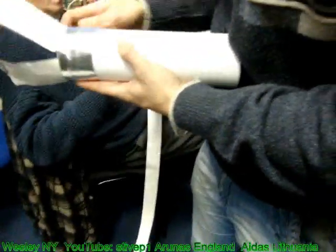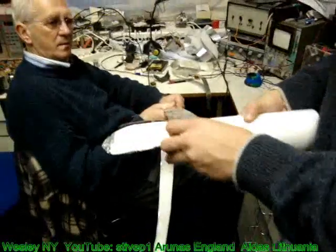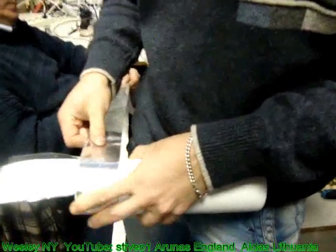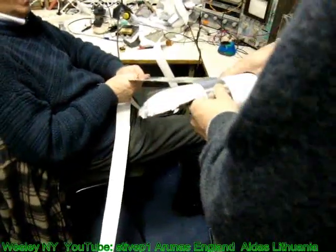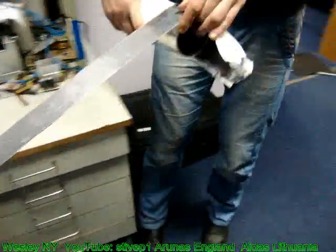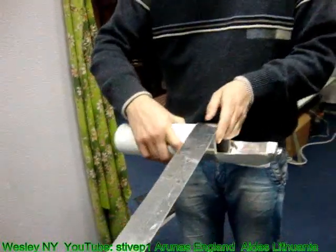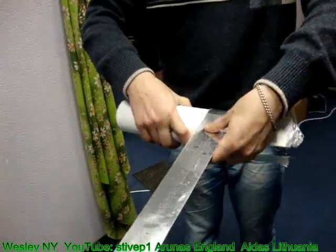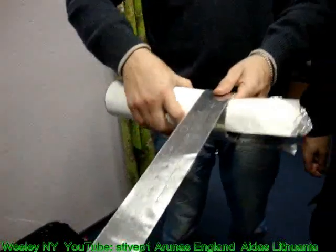There were 3 people who were winding that, helping each other. So we roll it as a pancake according to the Tesla concept. By that token, we have these 2 strips insulated together. Again, this capacitor was unwinded, and we use additional insulation in between these 2 ribbons all together. Pretty easy to be done. This structure has extremely increased capacitance compared to regular coil. It does also have the inductive component. So inductive reactors and capacitive reactors is present here.